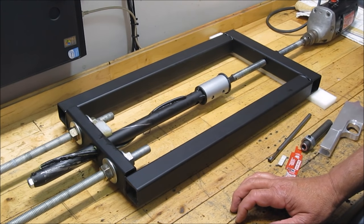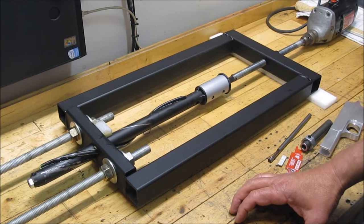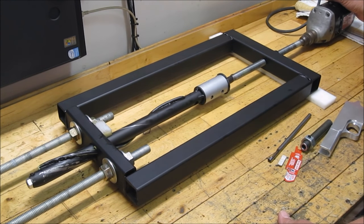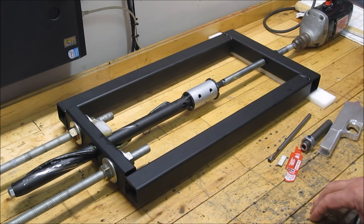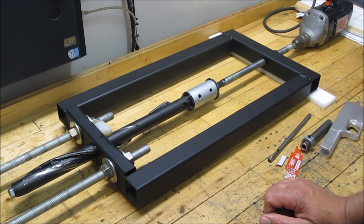That's your twist programming right there. Cutting grooves in a barrel by hand is not easy — it takes very small cuts to get smooth results without chattering, you have to make a nice smooth pull, and I was never happy with that method. So I always intended to mechanize it in some way. I thought about using a long lever or hydraulic ram, and settled on a simple threaded rod to act as a drive screw or lead screw attached to my drill. The only thing I had to determine was how to attach these two different rotating pieces together.